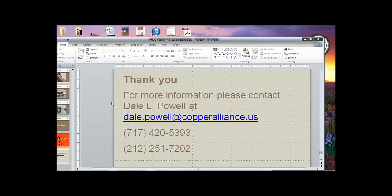Another question just popped up. It says, I have been trying to find the publication on soldering lead-free valves on your website and can't find it. If you go to copper.org and go to applications, go to plumbing, tube, and fittings, or you can go into publications. The publication number is A4108, Recommended Practice for Making Solder Joints in No-Lead Copper Alloys. Additionally, there is a video in our DIY section of videos that is based on the testing that CDA did for soldering of no-lead copper alloy valves. That one can be found directly off of the piping page at copper.org.